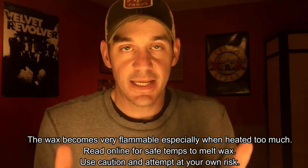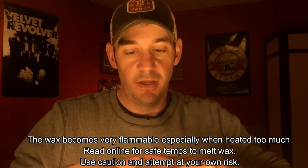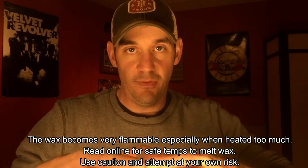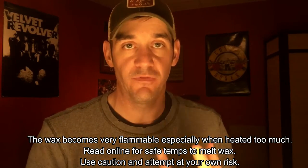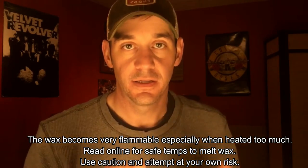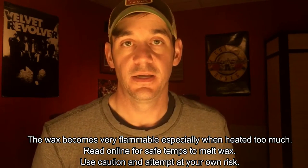The most important tool and the one I would never pot a pickup without is a thermometer. I would never advise anybody to attempt to pot a pickup without one, and there are two reasons. Number one: when this wax is heated it's just like a candle — highly flammable. You're heating up a huge batch of wax and this stuff becomes like gasoline when heated. One little spark, an open flame from a water heater, or a cigarette can cause it to ignite, catch fire, burn you, and even burn your house down.